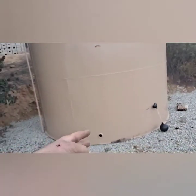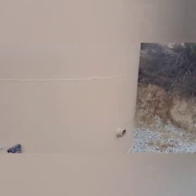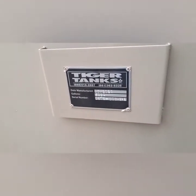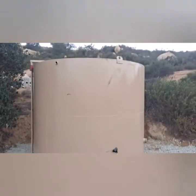They're going to look for this to be accessible by the road, and they need to see both the connection and the gauge. They're also going to look for this manufacturing plate—it specifies galvanized steel, gauge, and so on. It's from Tiger Tanks. I've got to grab some plugs for some of these fittings. Got a lot of trenching to do. Fire tank installed.